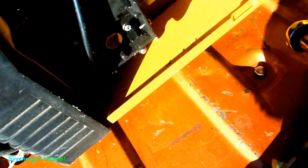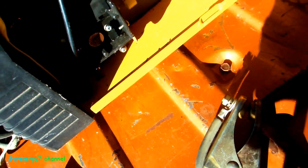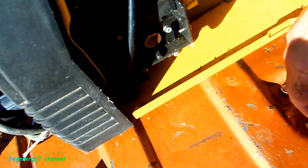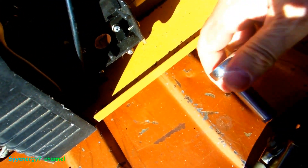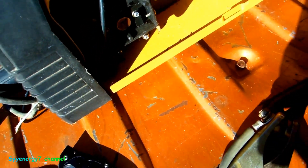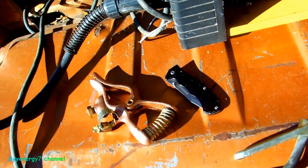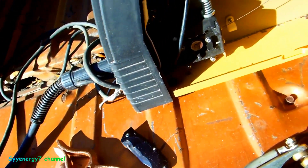You know it's kind of cool when you post stuff online because people tell you things. I changed out this flux wire with better wire and that made a big difference too. From the other welder, I found the clamp works — I put a 300 amp clamp on that one. I'm gonna put a 200 on this one, more than adequate, a pure copper clamp.